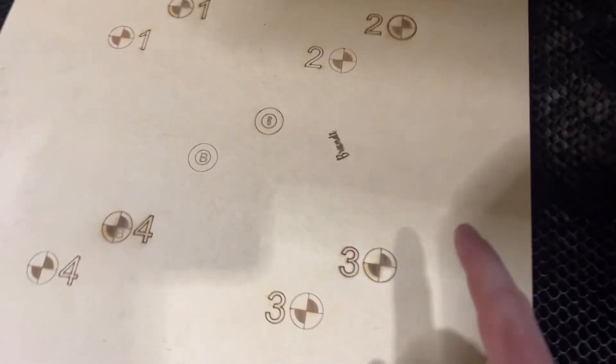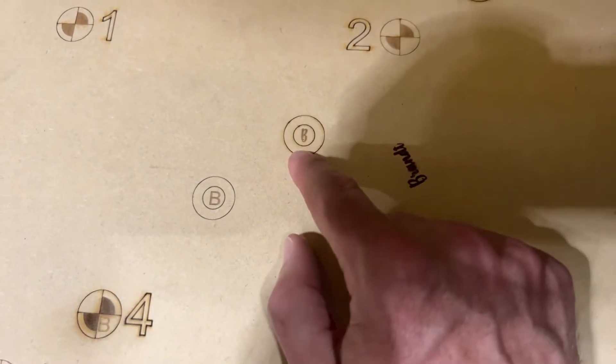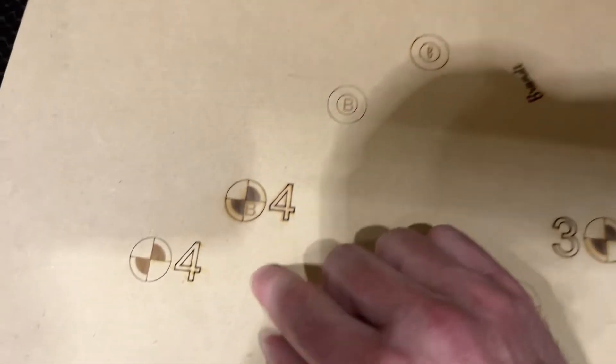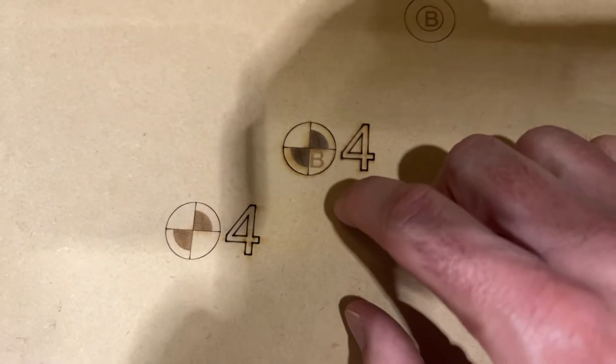Here you can see I've done it a couple of times, just testing out what got me the best results. It puts out these one, two, three, four points and you pick them in the correct order as you go through the LightBurn setup. You can see here's some of the results — I dragged my target point and was able to get it right in these targets, set it just off the lines, and got good results.